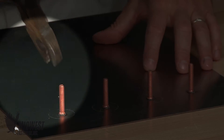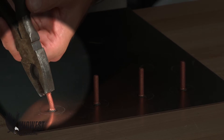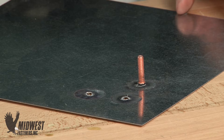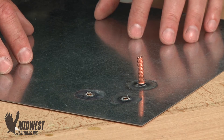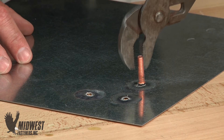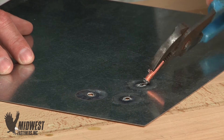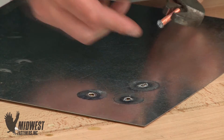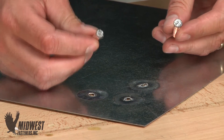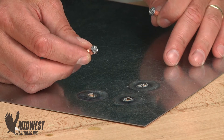Testing again shows the strength of the CD weld, which is strong enough to fail in the fastener before it fails in the weld. On very light gauge materials, the base of the stud will actually pull out of the material, maintaining the weld under stress, rather than show failure in the fastener. In this case, the weld is maintained, but base material is not sufficient to support the load. Therefore, the base metal shows the failure, but the CD stud weld still holds.